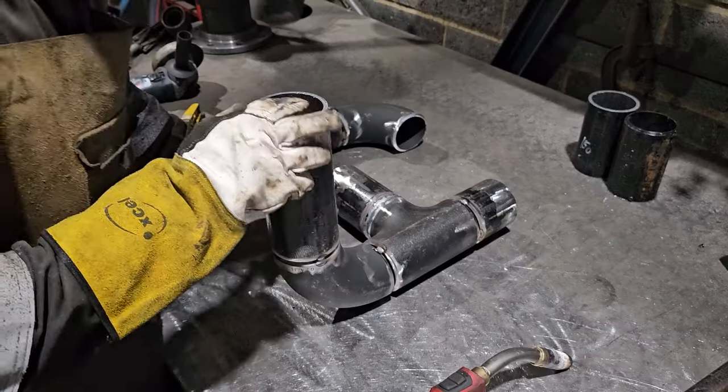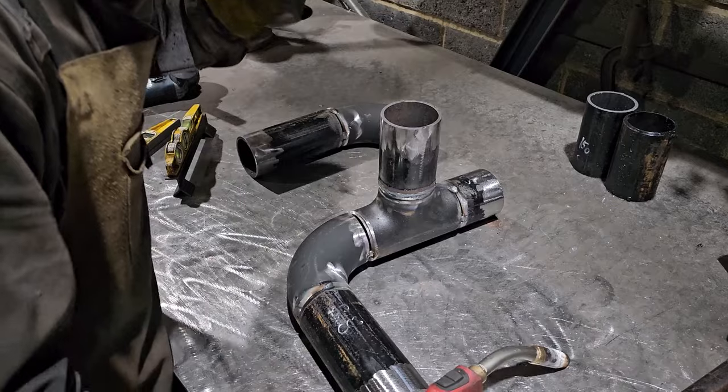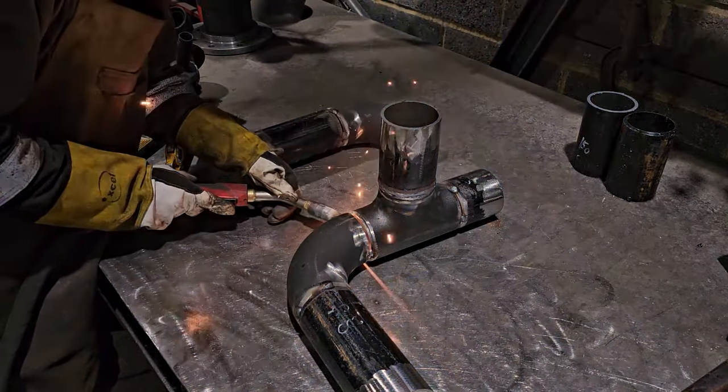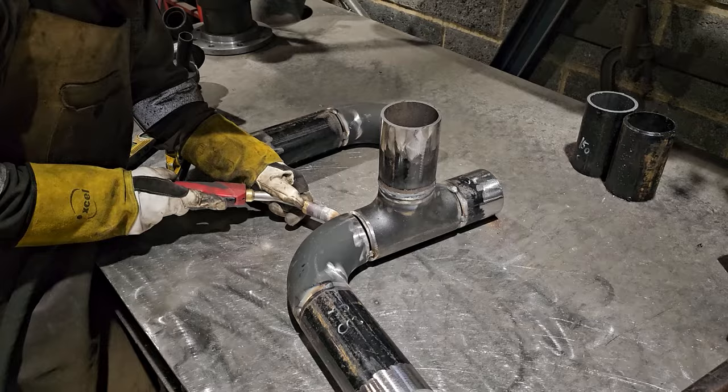Here's a quick tip and a tool I've got - two bits of angle, small pieces, about 20 by 20 angle. It just sets over things and you don't have to put it on bolts, so you can go over the weld. You want to take an average across a longer length rather than just measuring the tee or fitting, because things naturally become skewed when you're rushing to fabricate. You can see it bubbles out because I need to weld the backside - it's going to shrink, so that's a bit of preventative shrinkage measure taken there.